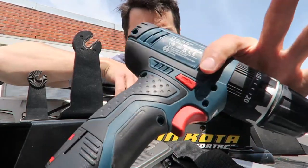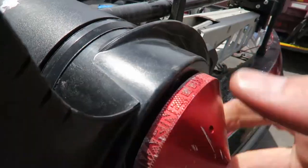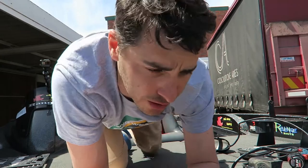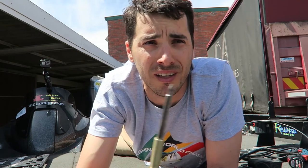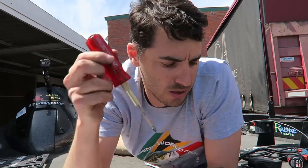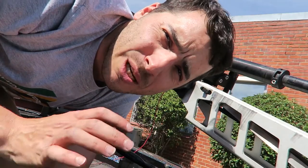I'm a power tools guy, so I'm going to use my little hand drill to undo all these nuts and bolts. We've managed to get all the cables undone — all the transducer cables are off, the hydrowave cables are off, everything's loose and free. I've taken off my bracket for the transducer mounting. Now I'm going to get down into the foot pedal, and for this job I don't use a drill — I'm very delicate with those threads on the foot pedal. I need that extra long length to get in there to get the foot pedal off. I'm going to loosen the foot pedal and then basically have the whole Fortrex loose except for the actual motor mount, then open up the panel and undo the electrical cables.